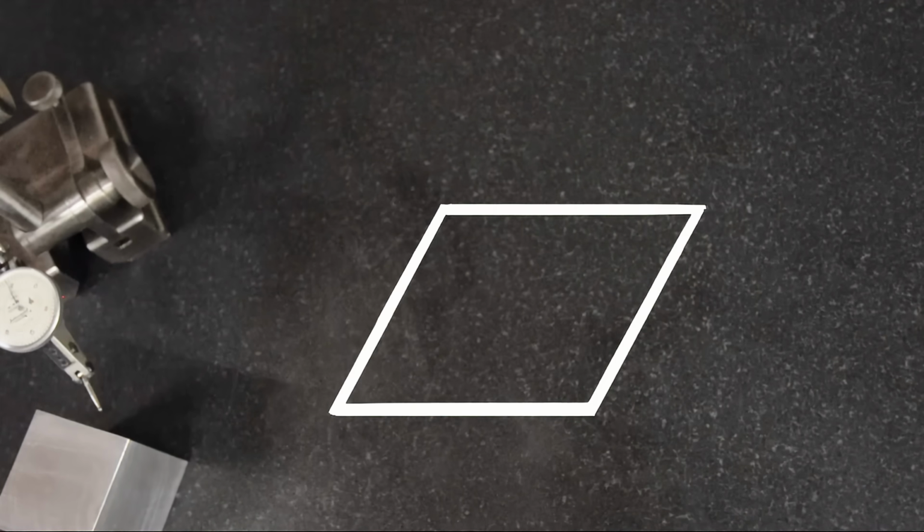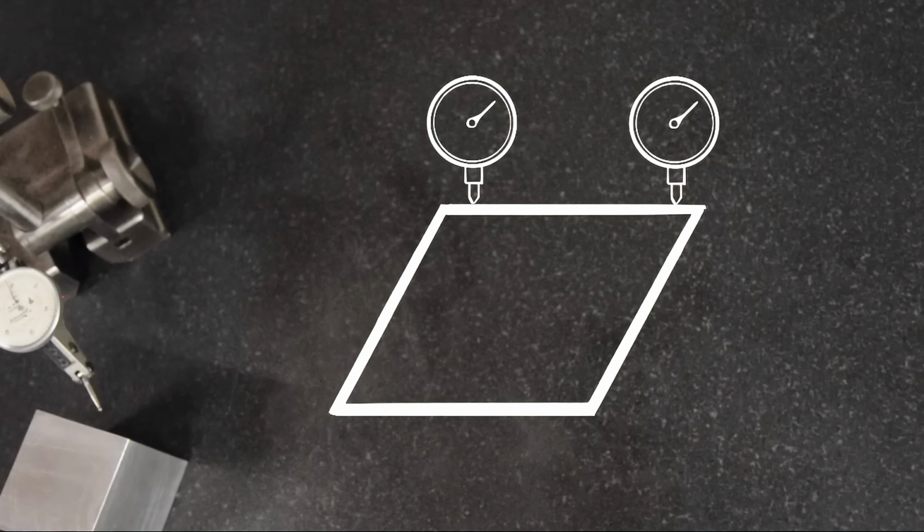Let's start with this shape here. Not coincidentally, you can tell just by looking at it that it's not square. If you know the name of this shape, leave a comment down below. So let's assume our block looked like this shape. If you were to measure with a micrometer or sweep it on the surface plate, you'd find that each set of opposite faces is parallel. No matter how you turn it, you always get the same measurement. The moral of the story? If something checks out as parallel, it doesn't necessarily imply that it's square.